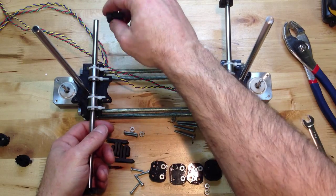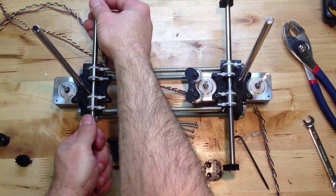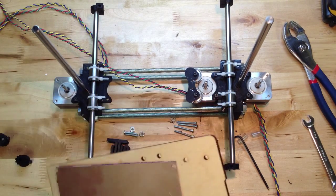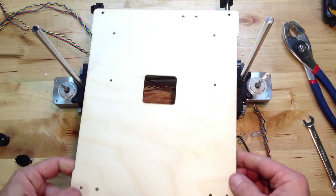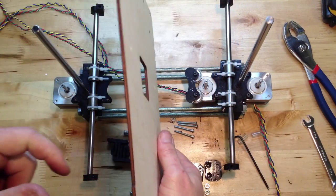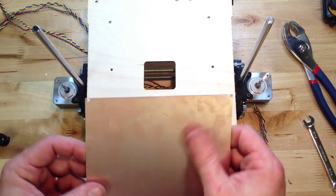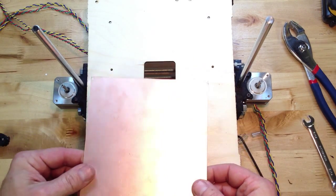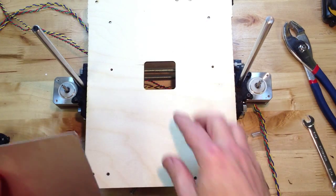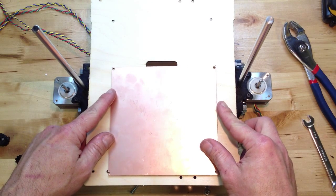You can take the bars off to do this. To be fair, I pre-fitted these to make sure they fit — sometimes I drill parts out so they're a little easier to assemble. Now, before I put the print bed on, I want to show you a couple of things. Before when I showed this, I didn't have the hole in it, but I want to demonstrate how it's going to go — it's going to go on here like this. This is just kind of a dummy piece; the ones you'll get are a little thicker. It's going to go like that and we'll put the screws down in there. This isn't the actual heated bed, but it's the same dimensions. The reason there's a hole there is we actually have solder points on the bottom, and there'll be a cable that feeds down through that hole.